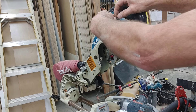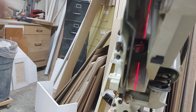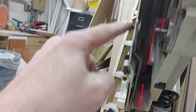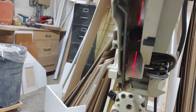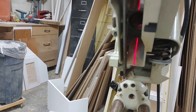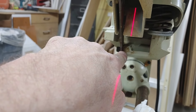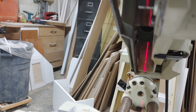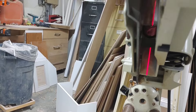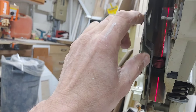I think I'm just going to put it in the center of the blade. Here's another critical piece right here — this part pushes up against that plastic guard and you can see it needs to be lubed. It's pinned at the end here and it does move a little bit, but right here it needs lubrication so that arm moves freely. You can see it's just rubbing ever so slightly on there, so I'm going to make sure that has a little bit of adjustment to it.